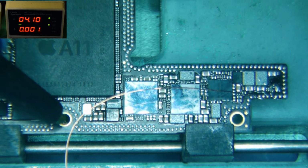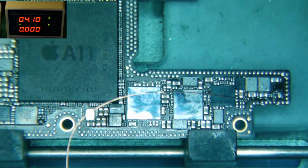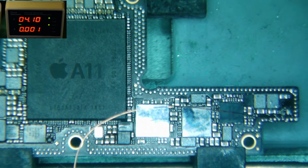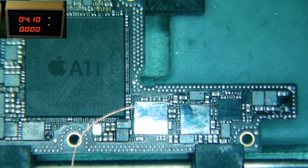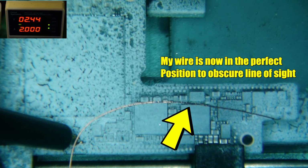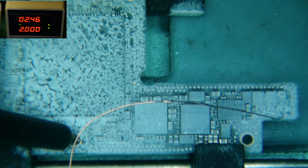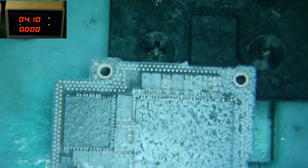And as you can see, it's going to pull current into that circuit, which should show us some heat somewhere. Hopefully I won't be blocking it with the camera. Let's check the upper end first. I can always move the board around a little bit, see if we're getting any heat anywhere other than where the wire is attached. Okay, I'm not seeing anything at the upper end. Nothing melted down here either, so this is lovely.